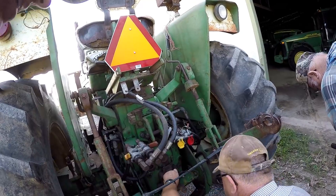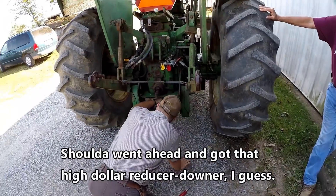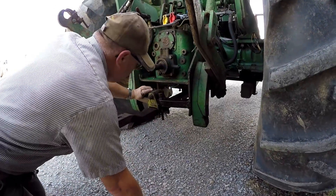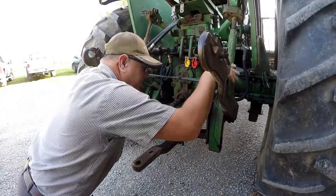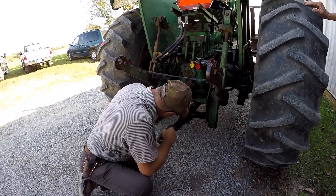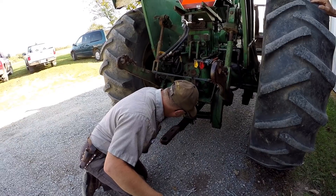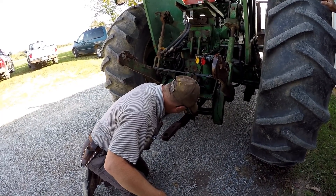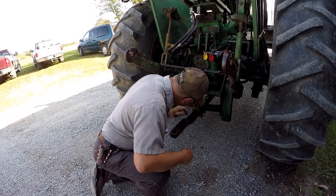I think we're good. That auger's got a $3,000 gearbox on it that lets you use a 1,000 RPM power takeoff. This new one that we got laying on the truck over there, we decided to stay at 540 on it and save the $3,000. I hope that was a good choice.